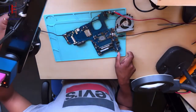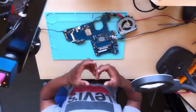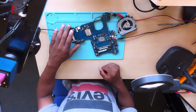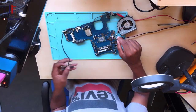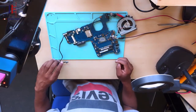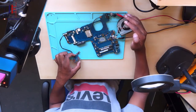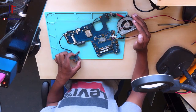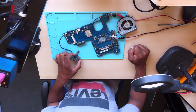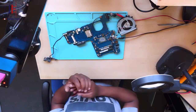Now let's test the board. Turn off the microscope — hope you can see the fan. I jumped the first MOSFET, so let's see if it turns on. Nothing at first — it's drawing current from the power supply. It's turning on! The fan is not spinning yet — it's taking 64, 600 milliamps... and there it goes! The fan is spinning and it's drawing 700 milliamps.